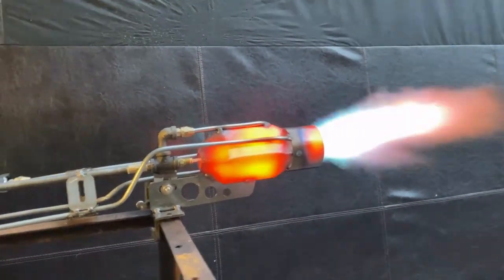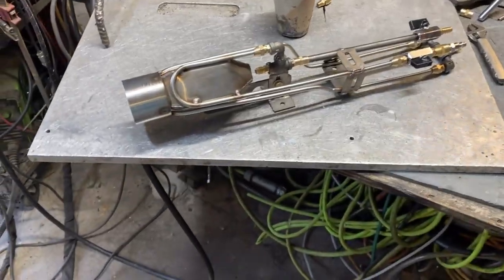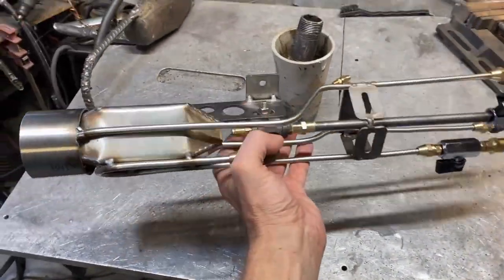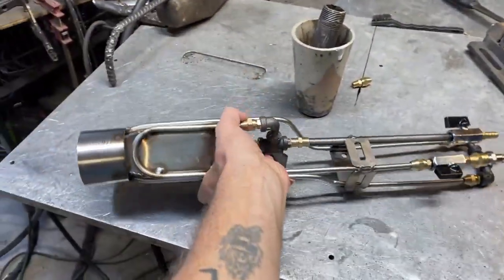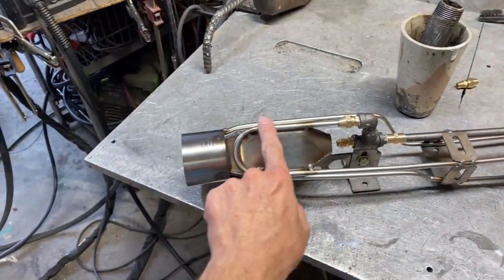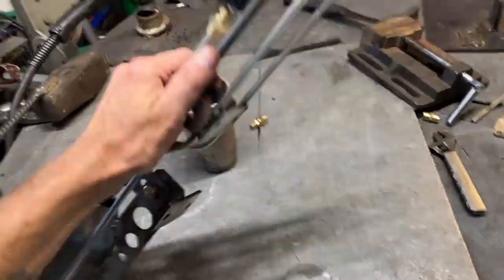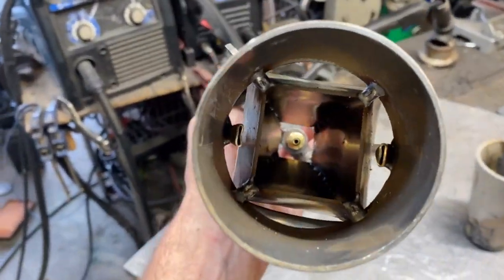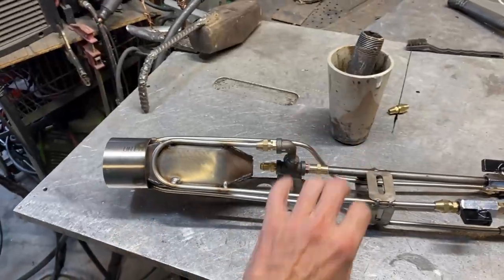To make a burner that can melt just about any metal we throw in the crucible. What we're looking at here is one of my latest contraptions — this is the Godzilla burner with the air preheat loop, but I've added a little extra. We've got a second line connected to this thing with two little spray nozzles that I'm going to be injecting pure oxygen into.